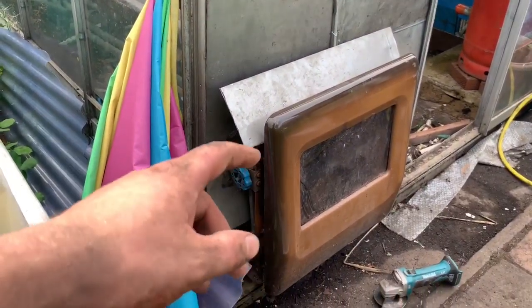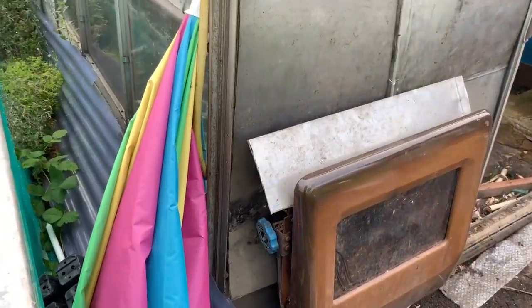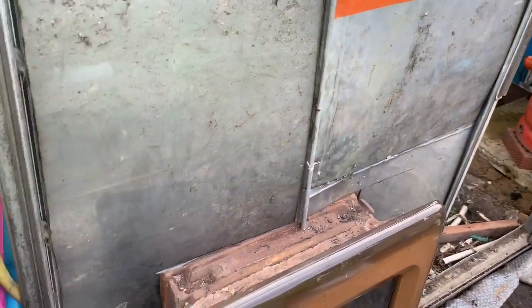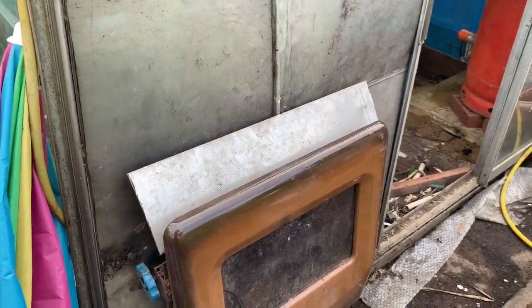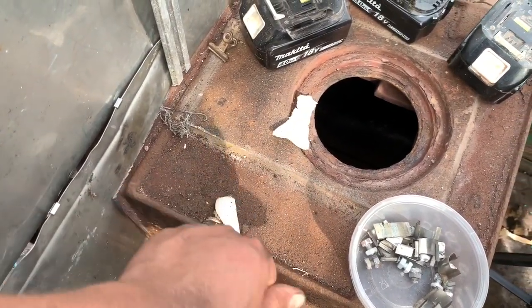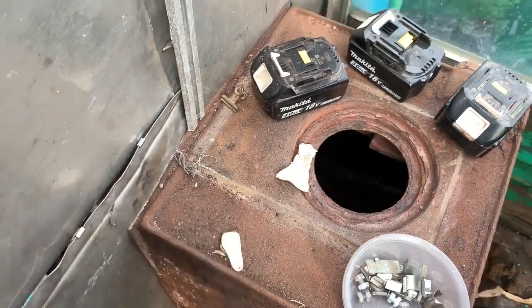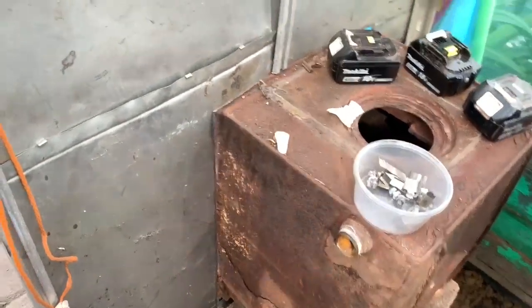Getting the fire put into place so the door's outside. Done. So get the frame cut, the metal frame around the fire, done. Cut even. Done. Little finishing touches to do that. That's fine. Inside, taking the top off of here, taking this bit off, re-cement seal and fire cement it back in. Done. And so that's all raised up and sorted and level.